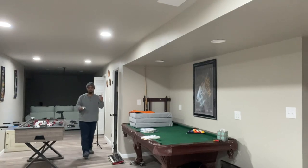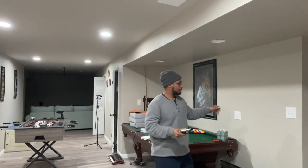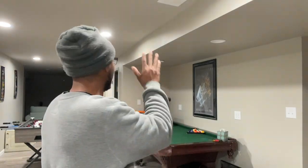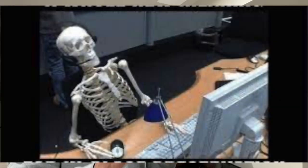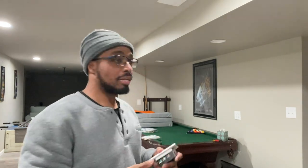The other switch for that three-way is right here on the corner. We are going to the circuit breaker, which is over here in the corner, and I am going to turn all the electric off for this hall right here — turning everything off so we are safe. This is no game — you can die doing electrical work.